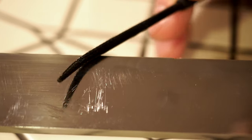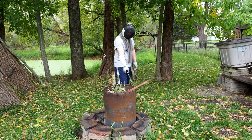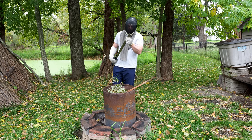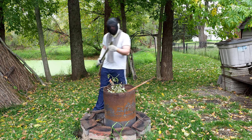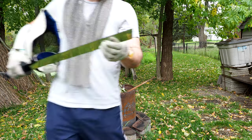Because it seemed soft, I tested hardness with my new HRC test files. The 40 file bites into the spine of the sword and the 65 file doesn't bite into the edge. I'm probably using them wrong, but the spine is very soft and the edge is very hard.